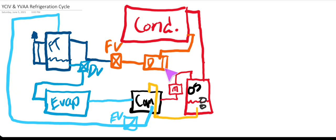Something not in the drawing worth mentioning: you'll see rubber hoses tying into the end tubes of the condenser — that's part of the coolant system. These units use what they call an inhibitor fluid. It flows through the VSD to help cool it through a little heat exchanger plate, and is also used to cool the electrical cabinet inside the chiller panel via a little water coil with fans that blow across it. York uses the condenser coil and fans to process out that heat through the inhibitor, and you'll see a green fluid flowing through those rubber hoses on this series.